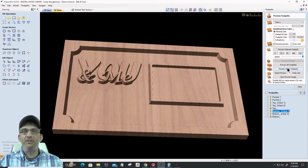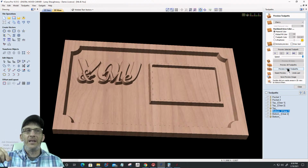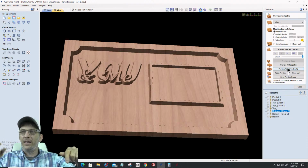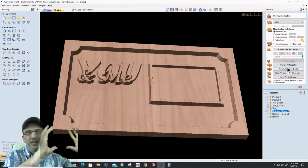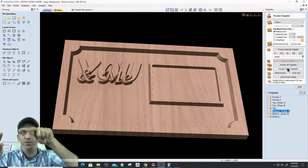But I have to physically write the script. The script is not like G code. It's a little bit of G code mixed in, but there are also other parameters in the PlanetCNC TNG. So I could do it that way. I could create a script that, no matter what project I bring in, when I run it, I can put a button in the software. When I run that button, it's going to look at the state of that program and run the parameters of it, right?